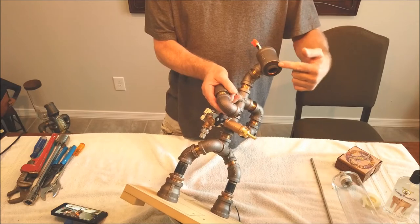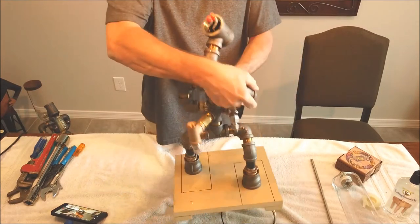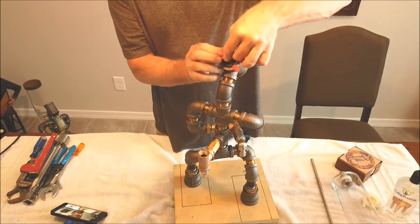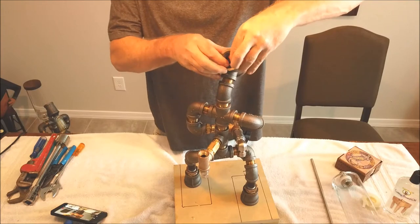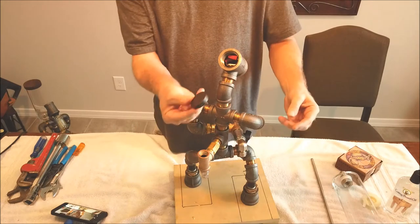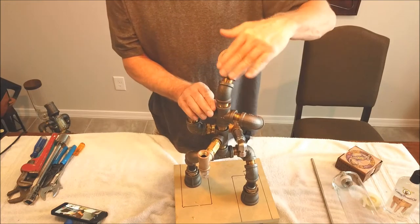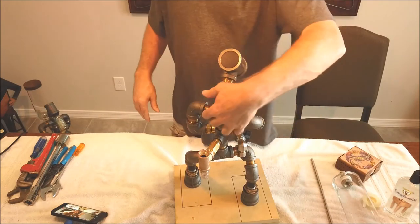I've got the light fixture, the light socket, just hot glued up inside here. It's really tight. It's not going to come back out. And then once you get the wires connected on the back side, just a couple of wire nuts here, you want to just take these, curl them up, and stick them down in there. There's plenty of room for them. And then once you've got those down in there, you've got this little plastic panel cap, inch and a half size. You just put that over the back and snap that in. And that back is nice and trimmed off flush, and you don't have to look at it anymore.